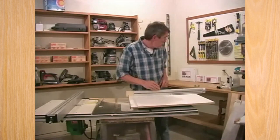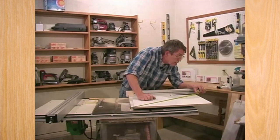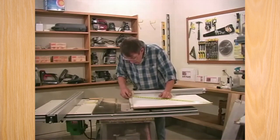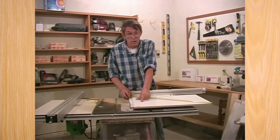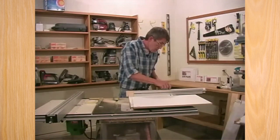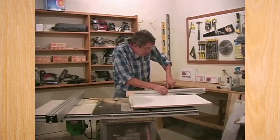I'm going to turn this around and grab my tape measure. The B-to-D side measures right at, just on the strong side, of 30 and a quarter inches. The C-to-A side is just a hair under 30 and a quarter inches. Since the D-to-B is long, that means we have to come a little forward. I want to loosen this — always tap down on this whenever you loosen it to rotate. I'm going to give it just a tweak, lock it down, and try it again.